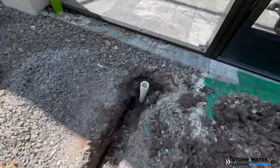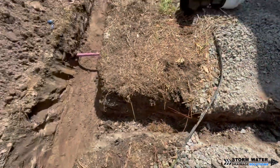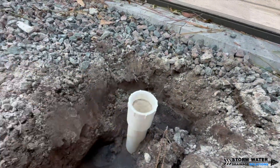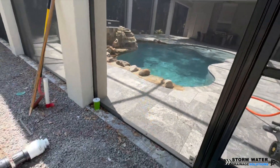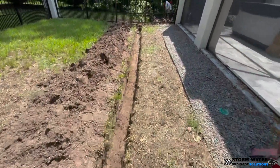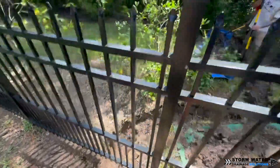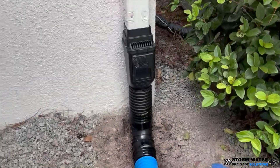The reason for this is because you never want to go down in size in drainage — you only want to go up in size. Now, that right there, if you were looking at the screen, is a pool overflow drain. We have tons of these in Florida. The way these work is a good example of how water seeks its own level. Once the pool becomes too filled, that pool overflow drain is slightly lower than the pool deck, so the water will begin to come out of that pool overflow drain instead of overflowing your pool.